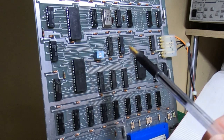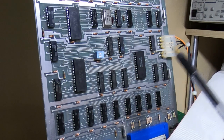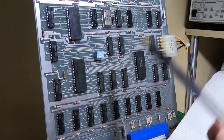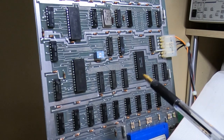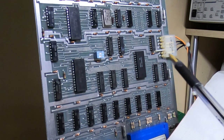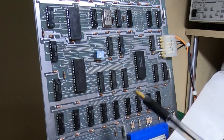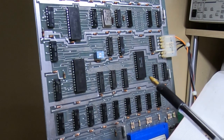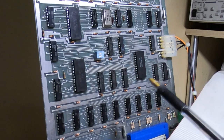About 1% of the vias on this board had not been solder-filled. I found corrosion in some of the holes and the vias weren't conducting through the board — so I had about three or four open circuits. I got around it by cleaning the hole, putting some pins through, and soldering from both sides. I think this was caused by me handling the board — it's a long thin board and it flexes when you move it, and chances are that flexing fractured some of the vias. When I found the first one I made a point of flexing the board intentionally so I could find and repair all the broken vias at once.